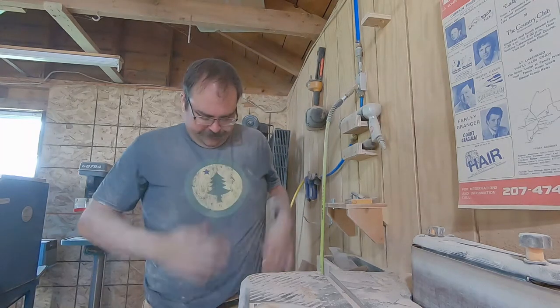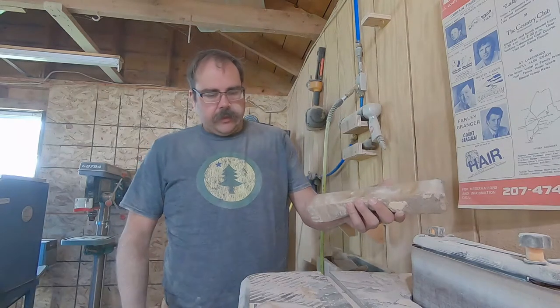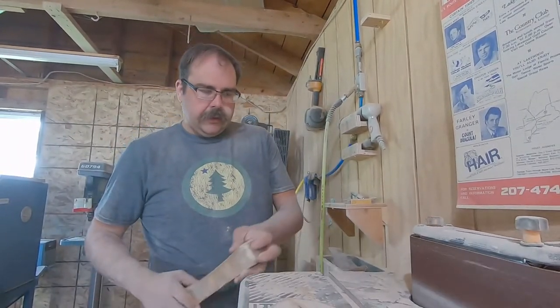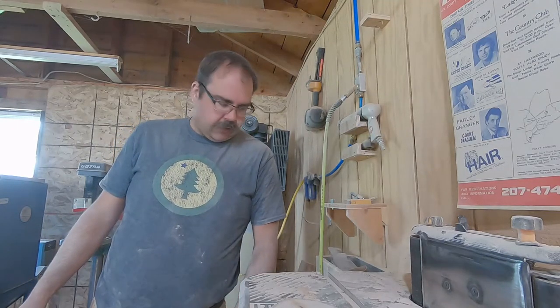Helpful tip — do as I say, not as I do. Probably a mask would be helpful. It can get dusty when you're sanding. I do have dust collection in here but this machine isn't set up right now and I was being lazy. You get all snuffy if you don't wear a mask, but it smells really good, so that's a positive. So we got those all sanded up to 220. I use this rubber sandpaper cleaning tool — it cleans it up and helps prolong our sandpaper, especially when you're using gummy stuff like pine, fir, and softwoods. I think I got that out of the Grizzly catalog a long time ago.